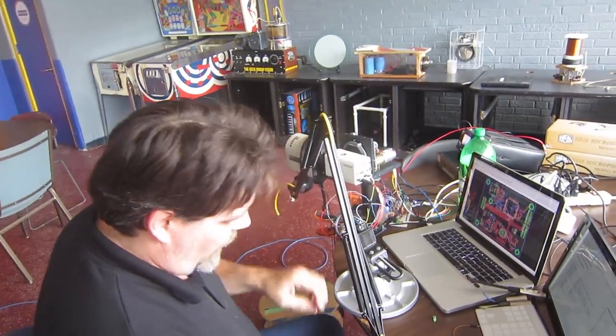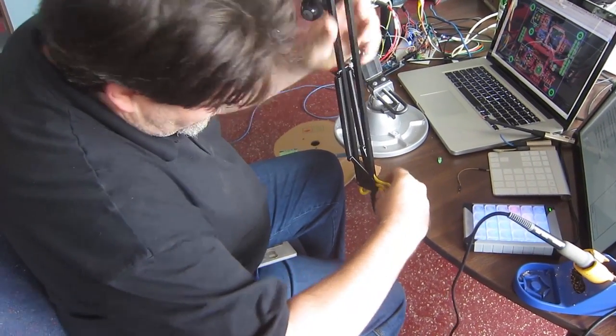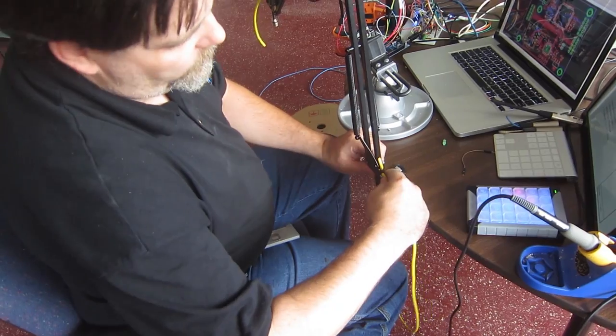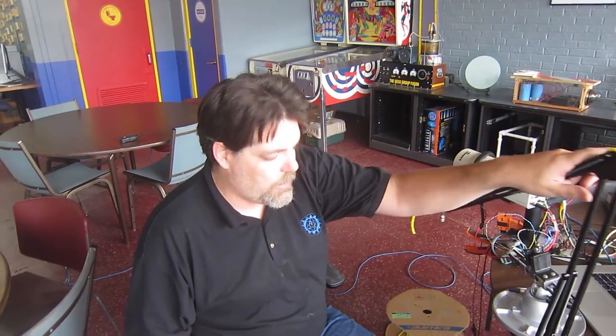And this cable is actually designed for this kind of use. This is Quad Star. It's got a braided shield instead of an aluminum foil shield, which I just recently Googled and learned is much better. It's better for non-permanent installation. Non-permanent installations are, you know, like handheld microphones that move around a lot. But when it comes to permanent installation, like if I'm going to run a microphone in the building and just have it there for years without touching it, aluminum foil shielding is actually better because it'll give a more solid connection over the years and it's not moving, so you don't have to worry about it breaking.